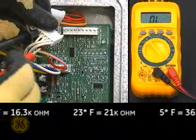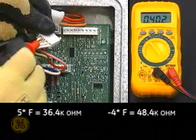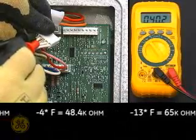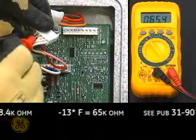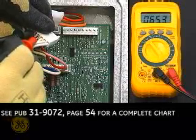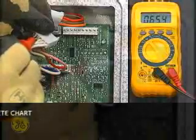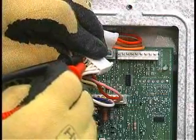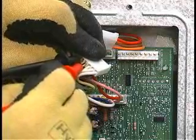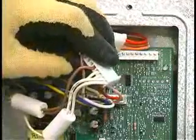Note that pins 1 and 2 are fresh food thermistors. Most models only have one fresh food thermistor, so you may have an empty bay in the connector. Pin 3 is the freezer thermistor. Pin 4 is the evaporator thermistor. When testing is completed, be sure to reconnect the thermistors to the board and reconnect power to the appliance.